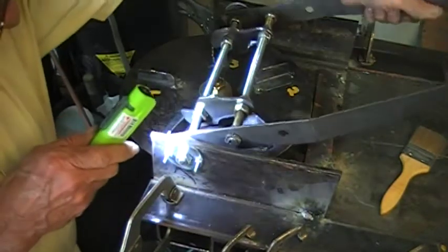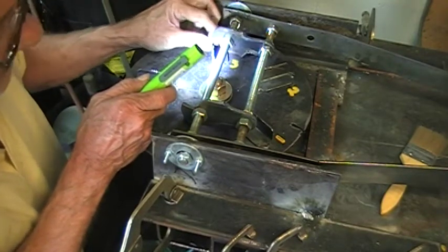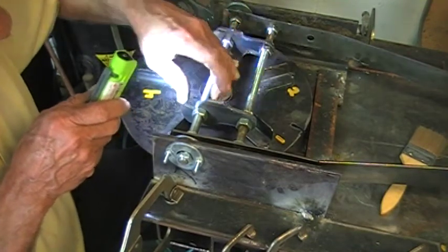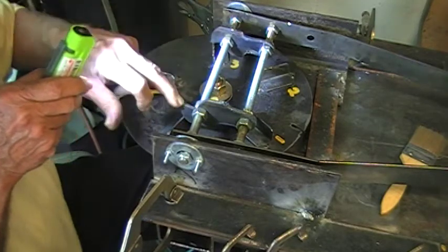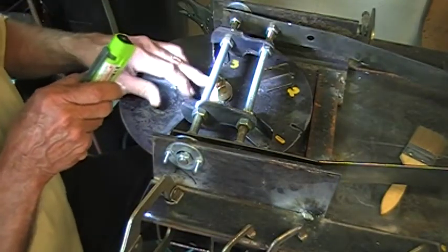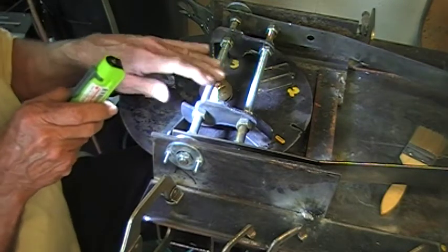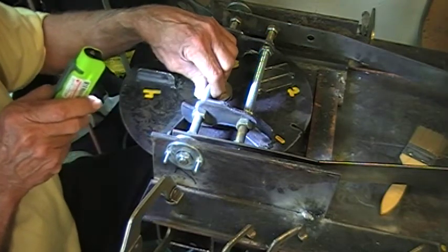I just thought I'd make this short video to let you folks know what I'm doing. Now this one's hanging up a little bit. I've made these from one-eighth inch steel. What I have to do is a little more finesse and just tweak this out just a little bit. I've made it with all-thread rod so we could move these in and out — that's one adjustment. We also made it so that we can adjust the plate itself this way to get it centered. These two bars right here have to be centered with this, and this must be centered between the two push bars and centered this way with the axle. That's why we use the all-threaded rod with the nuts so we can move it a little bit at a time. When we get to a bigger pinion using larger bars, we're going to take the nuts, drill them out, use slick rod, drill and tap them for set screws. That way we can adjust it and have a solid bar instead of all-threaded rod so it'll be stronger.